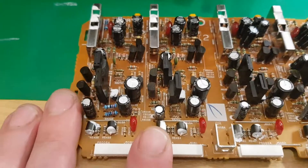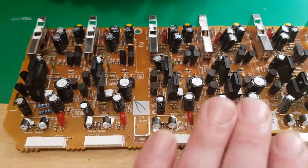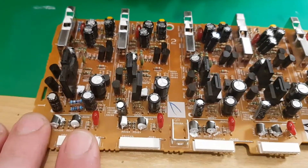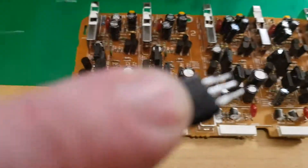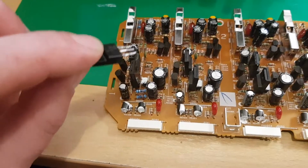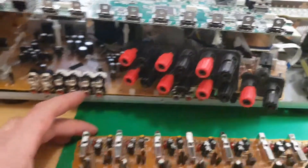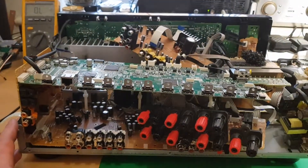To find out what the value was, I used the other channels — I measured all of them; they're the same. So, so-called reverse engineering. I replaced those two driver transistors in a matched pair. This one escaped, but to replace it, it needs to be a matching pair, so I needed to order that way. Now it's fine.